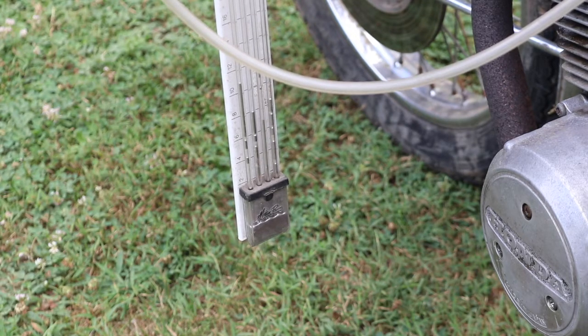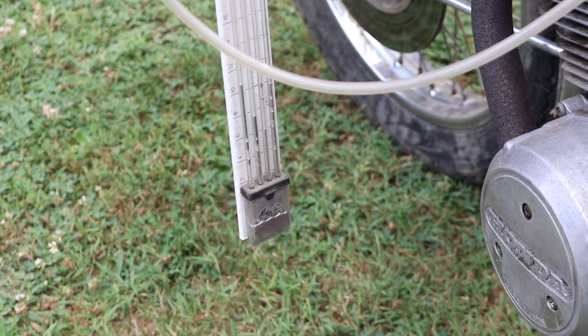So you see we're running here. I'm taking and changing the number 1 cylinder, closing it off just a little bit so you can see the vacuum go up on it. So you can see the changes that are being made by closing off the idle, causes the vacuum to go higher. Now you hear that popping that's going on.